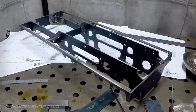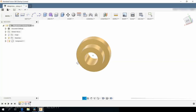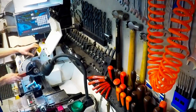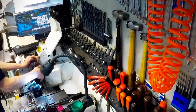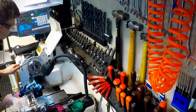Here we have the frame. The next parts we made are the brass bushings which are pressed into the frame. To make these I used the lathe, starting with a 10mm brass rod. To hold this in the lathe I used my ER32 collet chuck, the same collets as I used with the mill.